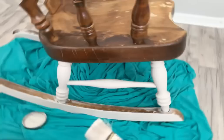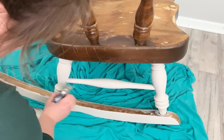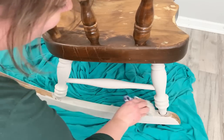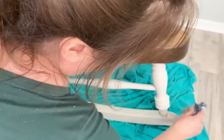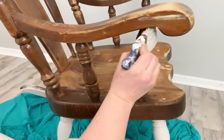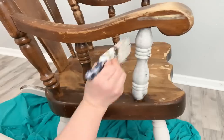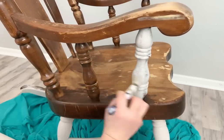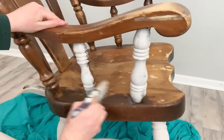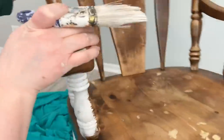This paint has really great coverage — it looks really messy on the first coat, that's usually how it goes, but by the second coat it's amazing, fully covered and even. I'm pretty sure this paint is self-leveling too, and it's an all-in-one so you don't need to prime, but it says if you think your piece has a lot of tannins you still want to use some shellac — and this piece definitely has a lot of tannins.